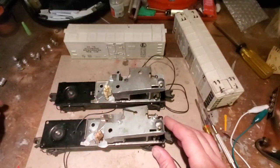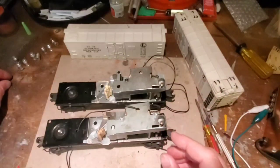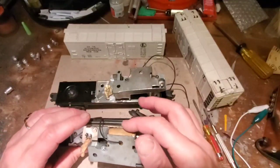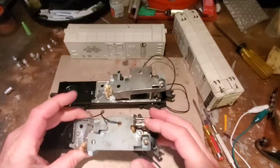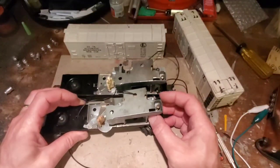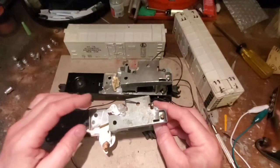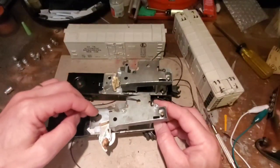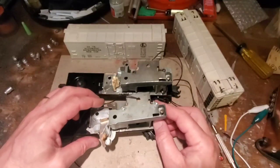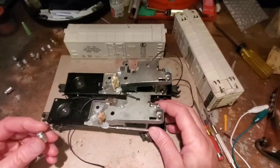So in essence, how this works is you drop your milk cans in like so, okay? And then through the electrical charge, it goes to a coil here, pulls this plunger in. The plunger then moves this man, the milkman, out, and if it moves hard enough, then it moves this little door here, and it releases, goes past where the milk can is, and then forces it out. And then he shoots it out into wherever you need it to go. It is just that simple.